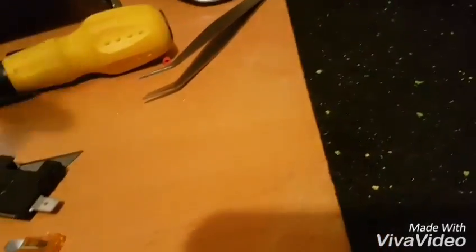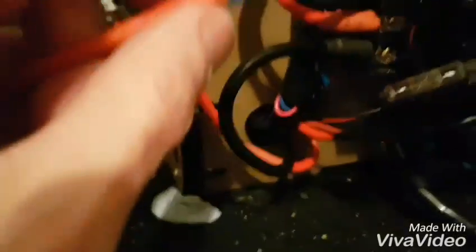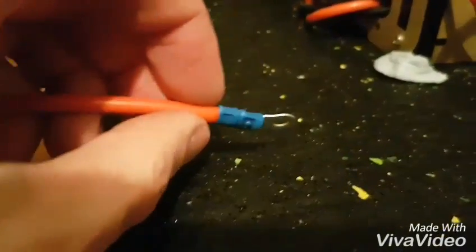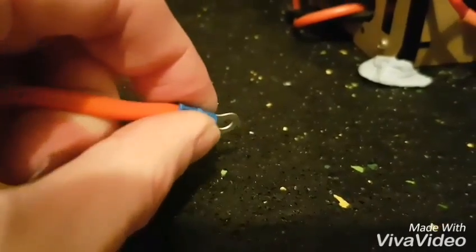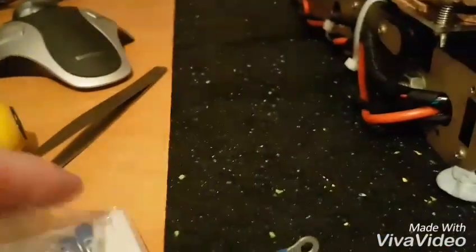When you put high-current cable on, best practice is not to just strip the end off, stuff it in, and screw it down. A lot of people do that and end up with melted connectors. What happens is the wires inside are not all compressed together, so they arc inside — tiny little arcs — and eventually that causes a lot of heat and melts the connectors.